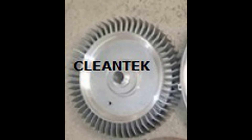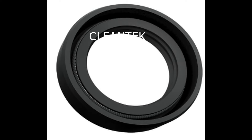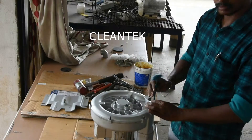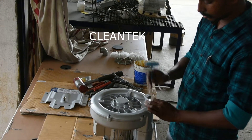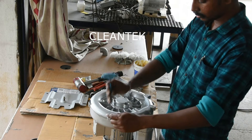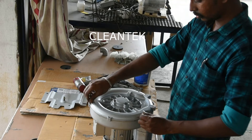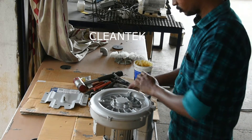In the ring blower, two models of bearings are used. The motor head side uses bearing 6202 and the fan side uses 6204. The bearing make is SKF, and it is an oil-sealed bearing. The oil seal size is 22-32-07. Take the proper model of bearing and oil seal.